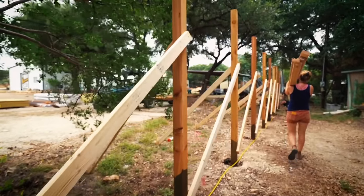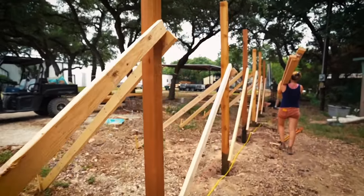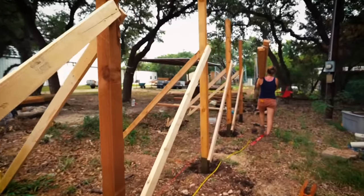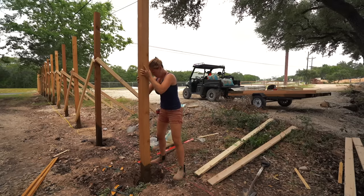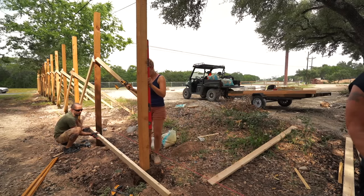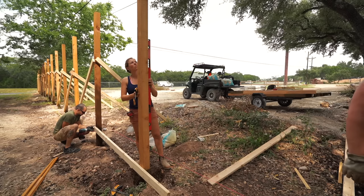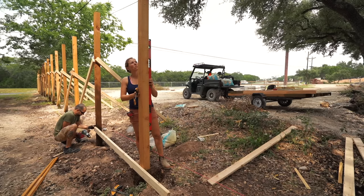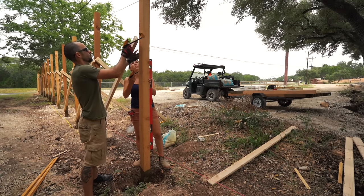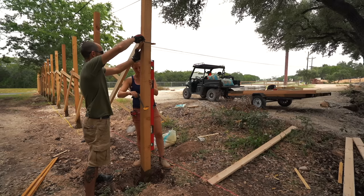First we dumped in some river rocks to create a standoff at the bottom and keep the post from being in direct contact with the ground. The idea is moisture will pool at the bottom of these holes but the gravel will prevent the post from sitting in it and being damaged. I'll leave a link below that explains it more thoroughly. Next the post goes in and then gets stabilized with two 2x4s. The first thing when the post goes in is to get the sitting position correct — making sure it's not only six feet from the previous post but also one inch from the string line — and then we would set the braces. For one of the braces we actually used the previous post instead of driving in a stake, held into place at the bottom with a screw, which also gave us a way to square up the post to the previous post.